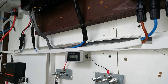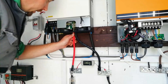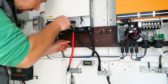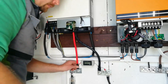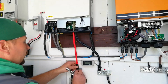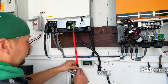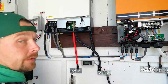To be honest, I have no idea if this is going to work — it's a complete chance I'm taking. Having the 24 volt unit AC coupled into the 11 kilowatt 48 volt unit will solve the battery issue as well as connecting in the wind turbine at a later date, but I have no idea if it's going to accept the generator input once it's cleaned up and passed through the 24 volt. We won't know until we start the system back up again.